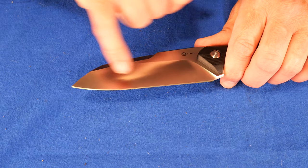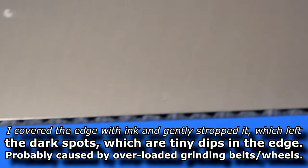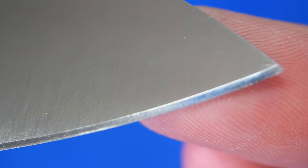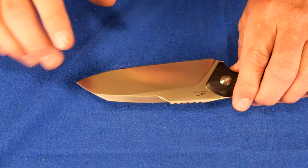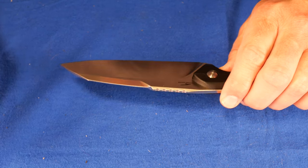This is after I've sharpened it. Let me show you some video that I took before I sharpened it. Here's the edge of the blade before I sharpened it. The dark spots you see is a little bit of ink left over from when I checked the grind angle, so you can see it's pretty rough. This is what it looks like after I sharpened it. It's got a much cleaner edge. This is just a working edge — not a polished edge, not a mirror edge, just a nice working edge. It's consistent all the way along the blade now. They didn't do a good job sharpening the knife at the factory. At 20 degrees per side, I just put on a working edge. It works really well, it cuts great, much better than it did out of the box.